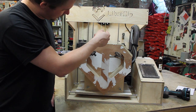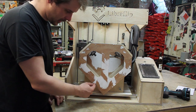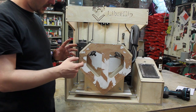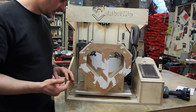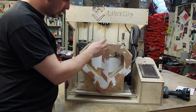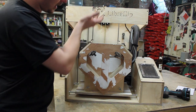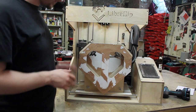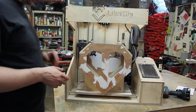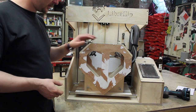So a beam that would come in from the top vertically like this would hit this mirror and would then continue horizontally over to the other edge and would then go up again out of the glass. And one can now calculate that with many different angles. And I think, and I might be mistaken here, but the theory goes that if I put the light about 2.5 centimeters up here, then all the direct reflections of the light would go into infinity out of the box, and none would hit the camera. And that's the big thing. I don't want any reflections on the glass in the camera or on the picture. So let's make a light that goes on top of this glass, is light and sturdy and provides great illumination and fits on top of here.